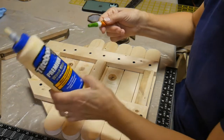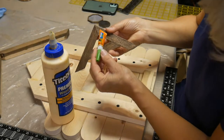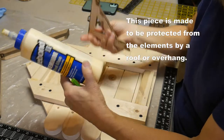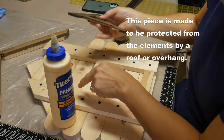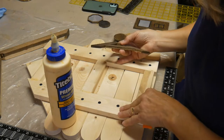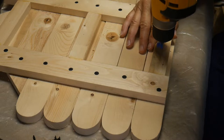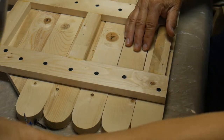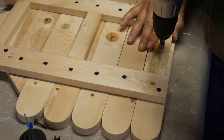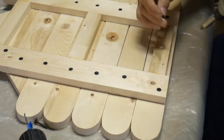A lot of the small pieces that I need to handle as one piece, I use super glue. And then I'll be using the good Titebond 2, or you could use 3, to glue everything together along with the screws because I don't want this coming apart. Here I'm just showing you how I pre-drilled the holes, marking the bit with a piece of tape for depth. Then I used a countersink bit and then a Phillips screwdriver bit to drill each screw into the pieces of wood.